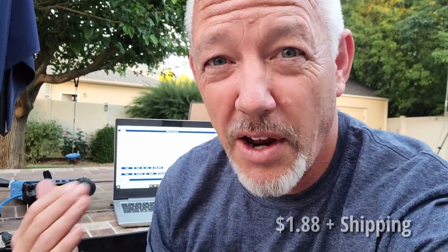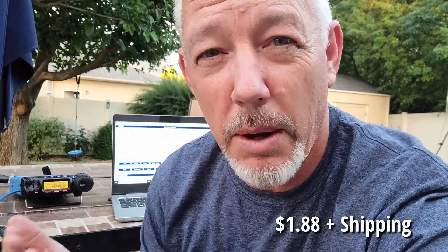That appeared to be the fix for me. The little encoder knob that I got replaced from Yaesu for only about a dollar was way worth it. I didn't like using my 857 because it skipped around a lot and I'd never end up where I wanted to be. Now it is so much better. I did some DX in the backyard with a little vertical I put up back here. I can take it on some Parks on the Air activations to get more power when the KX2 is just not going to be enough.